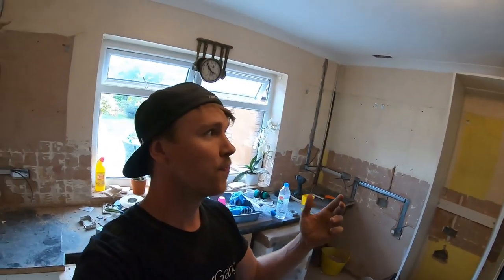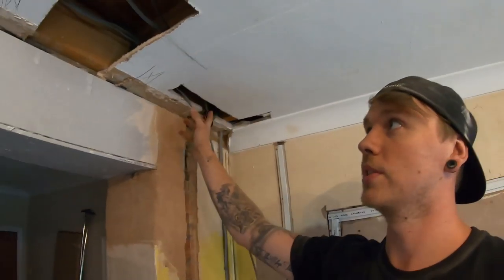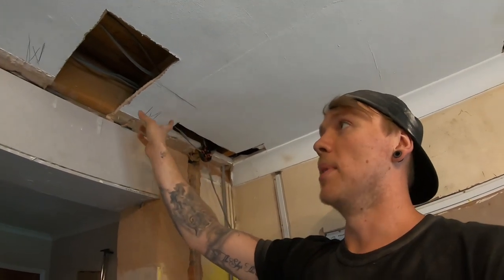Right, I'm onto the lights now, obviously we're gonna turn that off like I've just said. A few people have asked a request for doing down lights on a flat roof such as this. This has helped me a lot because obviously there's big notches in the ceiling. Normally that wouldn't be there, to be honest. What we would normally do is find the first joist. I'd normally use my 4-inch hole cutter, find where a joist is, do a plug next to the joist, get a measurement then to the next joist, do the same thing on each joist.